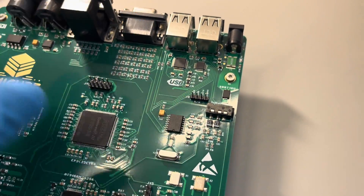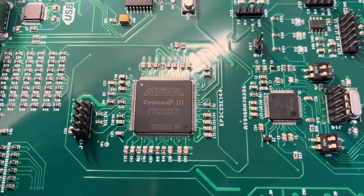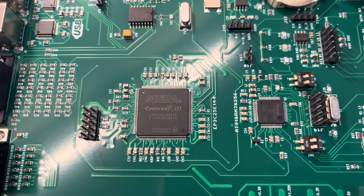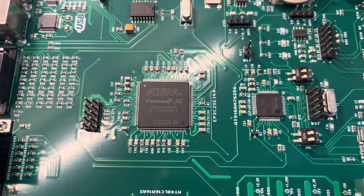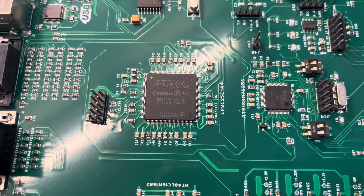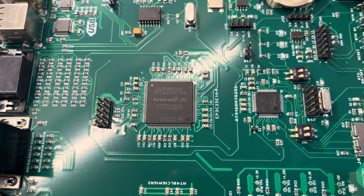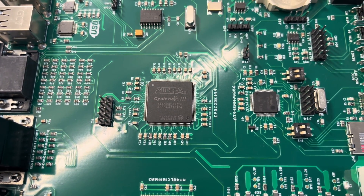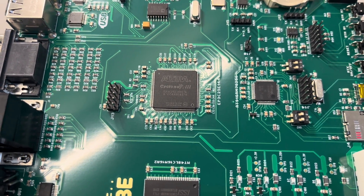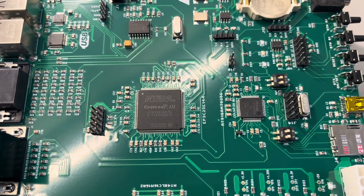Finally, the core of the system — the brain — it's an FPGA, a Cyclone 3. Because this chip uses the MiST platform, all MiST cores will work just fine, as far as I can tell after testing. I haven't had a chance to test every core, but there's no good reason they wouldn't work because I made sure that backwards compatibility is maintained.